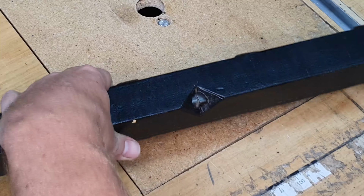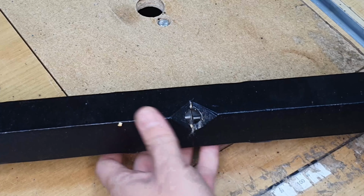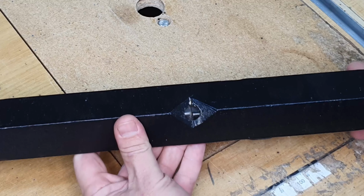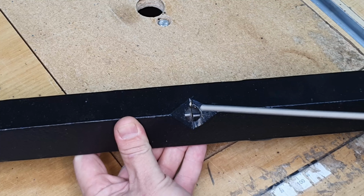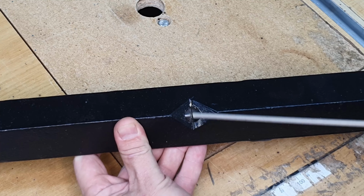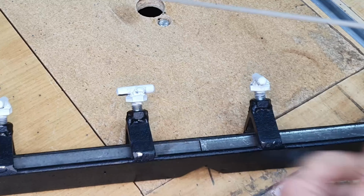And at the bottom of the big piece of angle iron, I also cut in a notch in the center where the 2 joints are kept in the middle, so you can also notch it at the bottom. So in order for the joint not to flex one way or to compromise the straightness of your pipe or tube when it's done. So this is basically it. Very straightforward, very simple, and a very easy tool that can come in very handy.